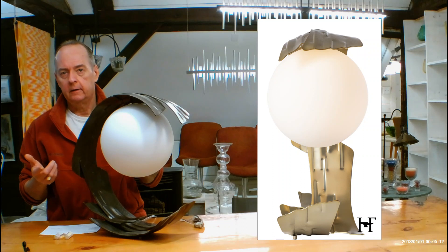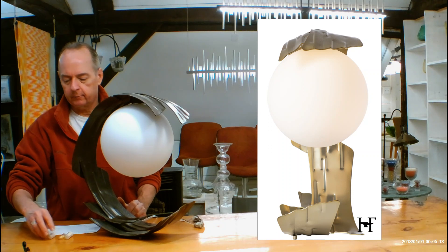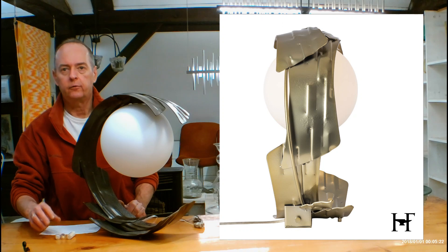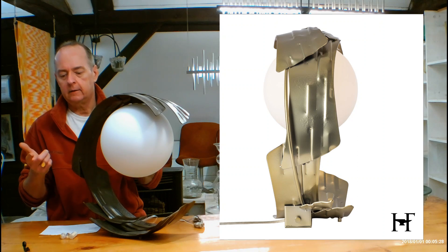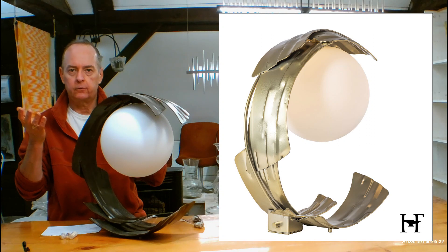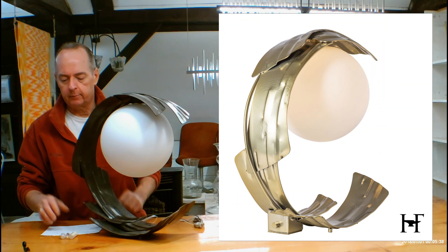It's easy to get these online. You could go to Home Depot or your Ace Hardware store and you'll find these bulbs there easily. But it's much easier just to hop onto 1001 Bulbs or Just Bulbs. We get these on Amazon — very simple. You would put in a search for G9 LED, 5 watt LED — that's going to be important — and a big page will pop up. You're going to want to zero in on the color temperature that you like. 3000 Kelvin is about what we like, and it's really important to make sure it says dimmable on that page.